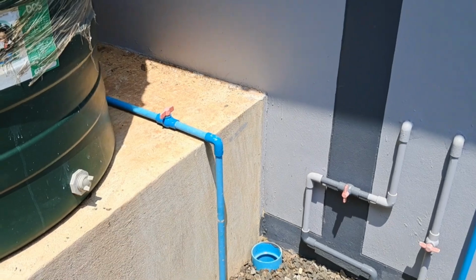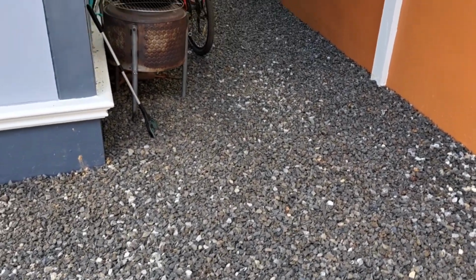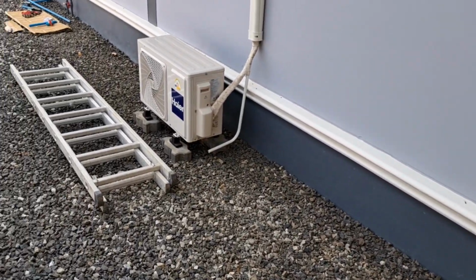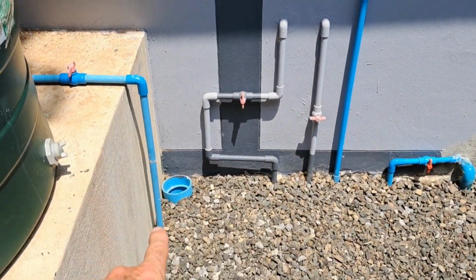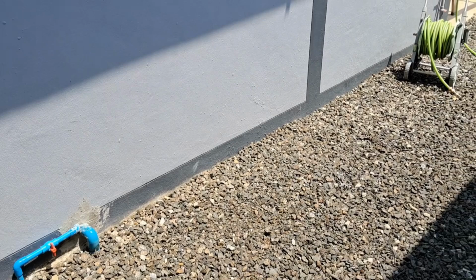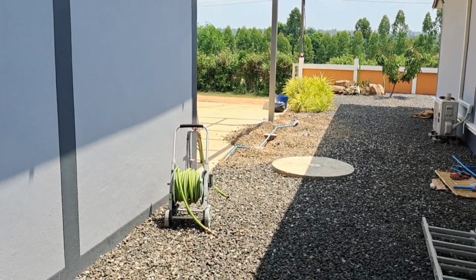So what I did was I turned this valve off again, and I want to see if it cycles again, which will lead me onto that valve up there as being the culprit. But if it doesn't, then I've got a problem in this line, and I'm going to have to dig the whole length up and check the whole of the pipe and go right to the very end through those plants, I think, as well, because this is only going to get worse, isn't it?